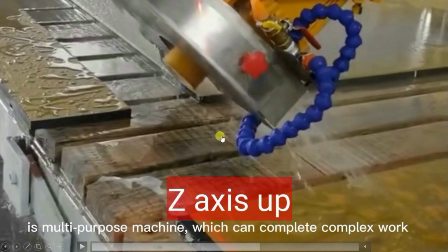Now there is a question. Here there is no sensor to determine that it has completed its shape. So how is it operating? Every servo motor has an encoder within itself. The motor and encoder are on the same assembly. Through the encoders, the drives get feedback that it has traveled the required distance.